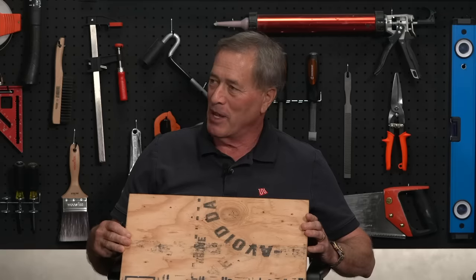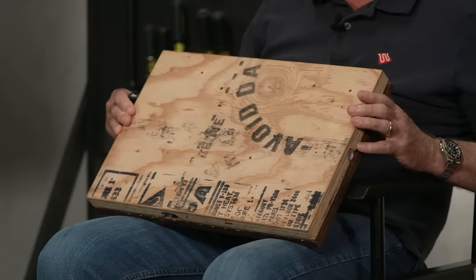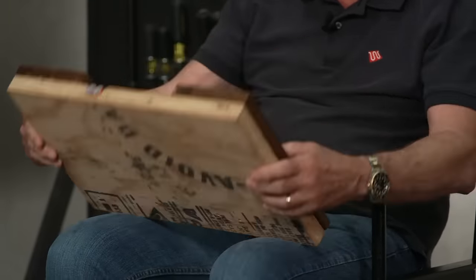When they peel off the aluminum, it shreds the panel — the glue is much stronger than the wood itself. We've also had that coating tested by the Tile Council of America and virtually every wood floor adhesive company — Bostik, Sika, Bona, all the major ones — for adhesion. When you glue your wood to it, you know it's stuck down and won't cup or warp. Early on, a cable TV installer went underneath and drilled up through the house, hitting a tube. So we started printing the pattern of the tube on the bottom as well, so plumbers and electricians in the crawl space can see exactly where all the tubes are.